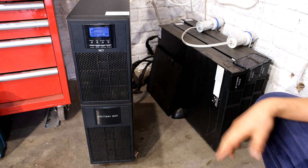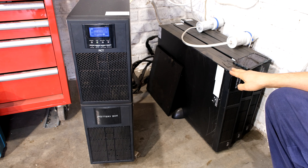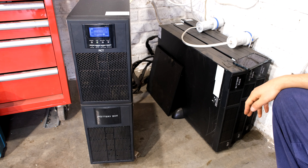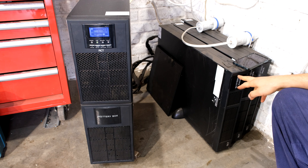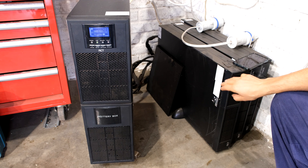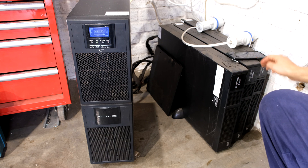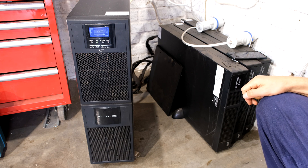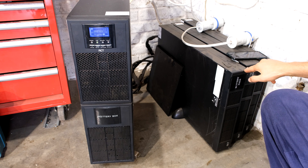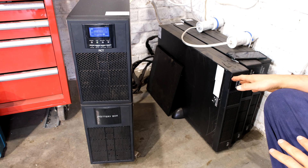Overall, the battery management of this UPS is terrible. If you've got a bad set of batteries in the bank, the voltage drops and it actually depletes the other banks, so you will age your lead acid batteries. If a few batteries have internal resistance failure, the whole voltage of the bank drops, which starts to damage the other working banks, and overall you will lose your lifespan considerably with this type of setup.